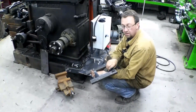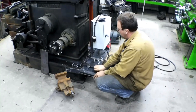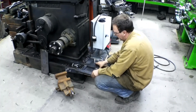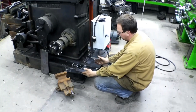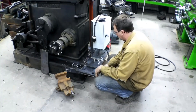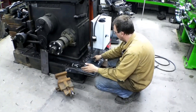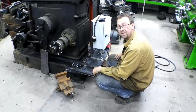Here's our plate or adapter — the holes are drilled and tapped. To do that I'm going to use the mag drill, clamp this on there, and get it lined up as straight as I can possibly get it. There is a little bit of give in a chain so I'm not too concerned. I already test fitted everything and it's pretty close. There's some warpage in my mount plate from when I built it, but I'm not too concerned. I'll get this lined up, clamped in place, and start drilling my holes.